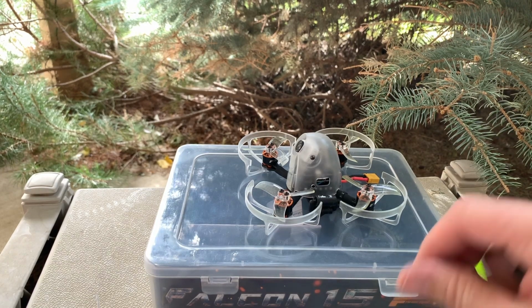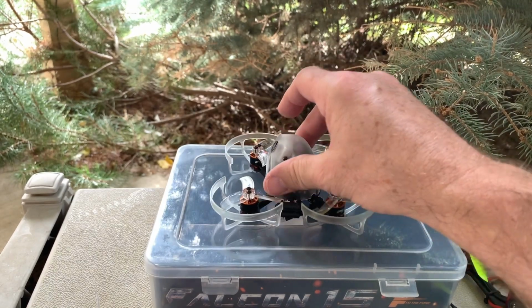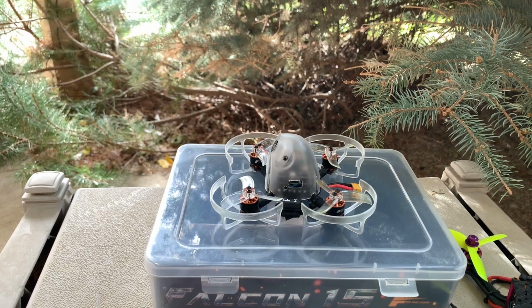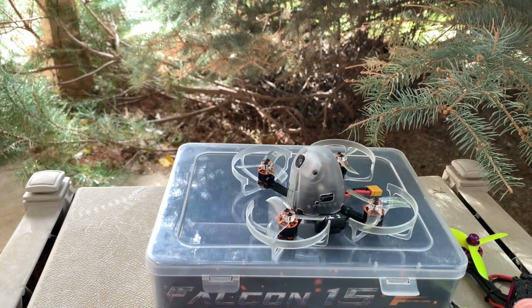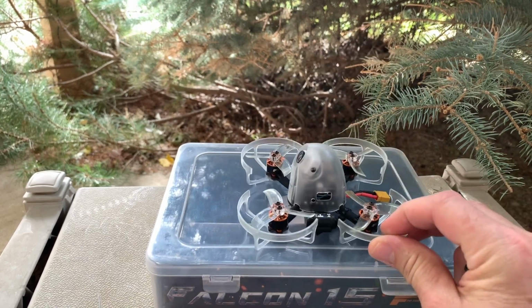The don'ts, don't upgrade to Betaflight 3.5. What's happening is on all F3 flight controllers, there's not enough memory. So to add new features, Betaflight developers are taking away some features like GPS, and one of the other ones that's pertinent to this is the LED control. So if you upgrade to 3.5, you're not going to have LEDs.